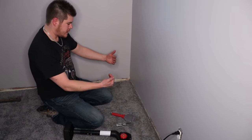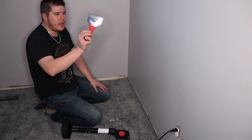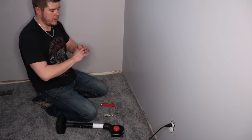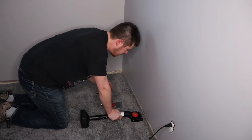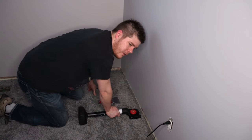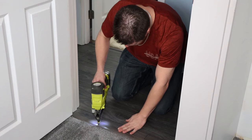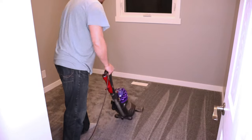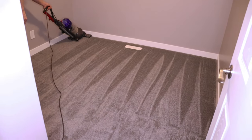The last thing we've got to do is trim off any of these little edges that are still sticking up. Use your knife and run it along the edge. Once you've done that, take this paddle spatula-looking thing — this is a carpet tucker. If you still have your baseboard installed and you're just replacing the carpet, once you've got it kneaded into place, use this guy and push it — it's going to tuck and slide underneath your baseboard and you'll never know it's there. Once everything is stretched, kneaded, cut, and finally laying in place, go ahead and add your door transition strip to finish it off, then clean up, because you are going to have carpet bits everywhere. But you can take sweet satisfaction in those awesome carpet lines.